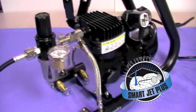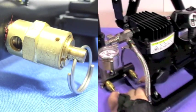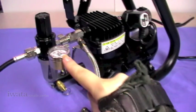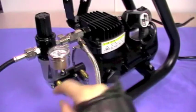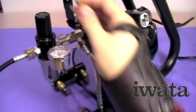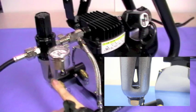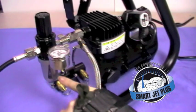Let's get in and have a close-up look at the air control systems in this compressor. First of all, we've got our nice easy-to-access pressure release valve. When you switch her back on, the tank fills up really quickly. And if you see here, you can see the needle very clearly on the pressure gauge, which is beautifully easy to read — nice and crisp and clear. We've also got a solid metal construction around the regulator system, a really easy-to-operate regulator which gives you fine control over your air pressures, and a moisture trap — solid metal around it, which is nice and secure feeling, with a nice easy-to-see window. On some that are just plain glass, it's very hard to see where the liquid actually is, but this has a nice window system so you can easily see the level as to when it needs emptied.